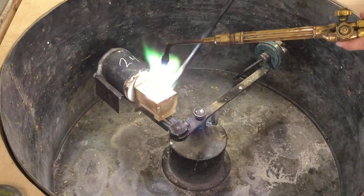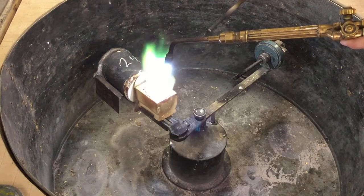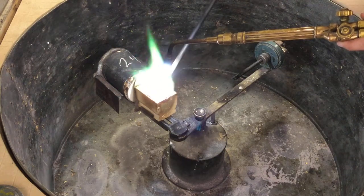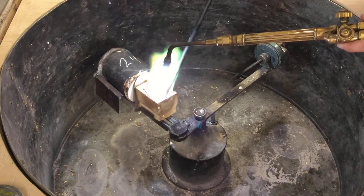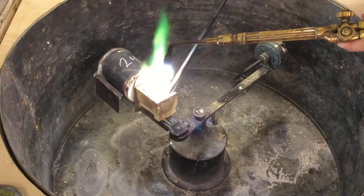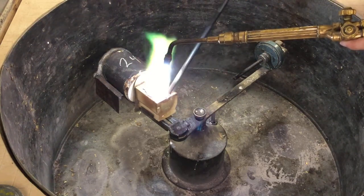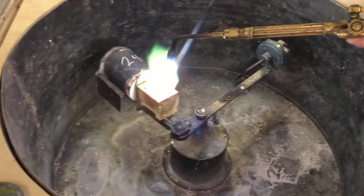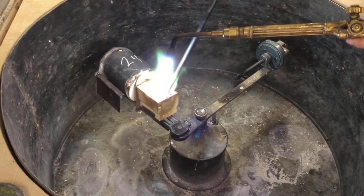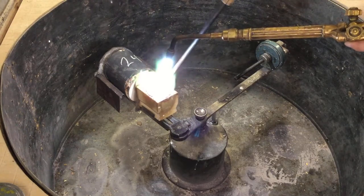Now when you're alloying, you do want to make sure that there aren't any pieces of copper that haven't fully mixed. So as your metal is starting to melt fully, it's good to check in the corners and see if there's any solid spots, because the melting point between fine silver and copper is different. You need the fine silver to melt and have the copper — which behaves like little solid ice cubes in your alloy — get mixed in with your molten silver.